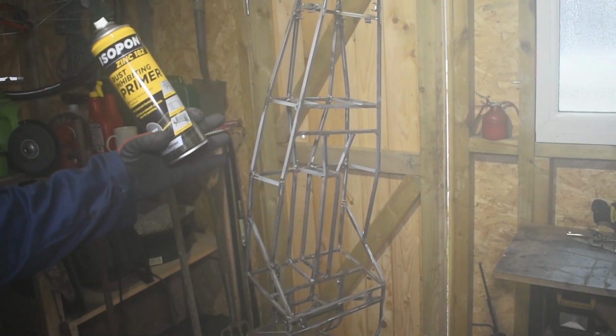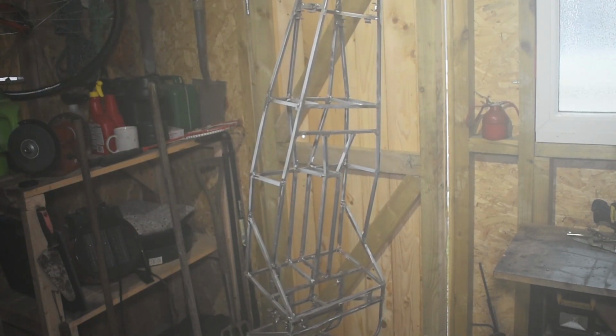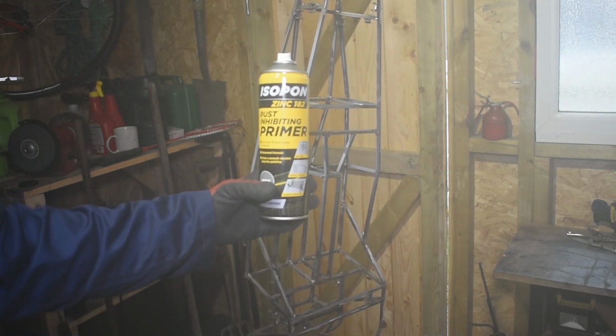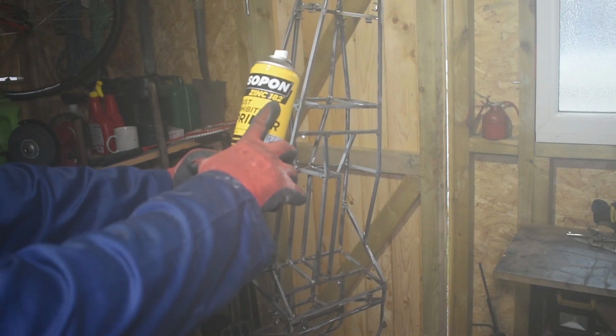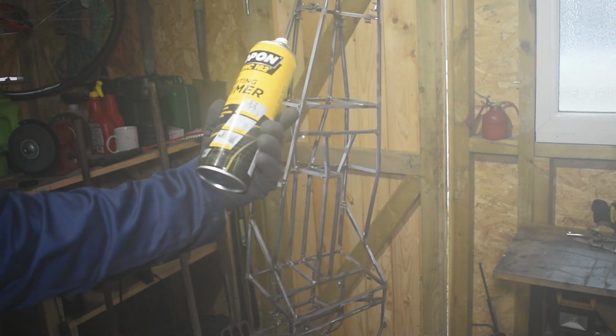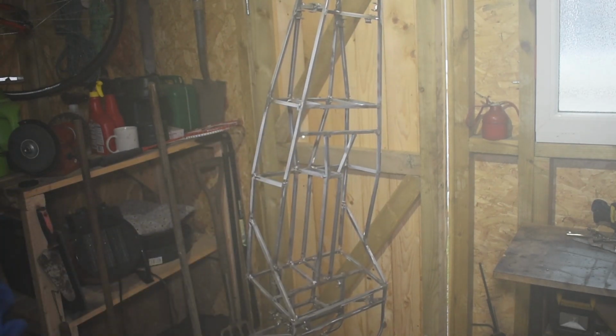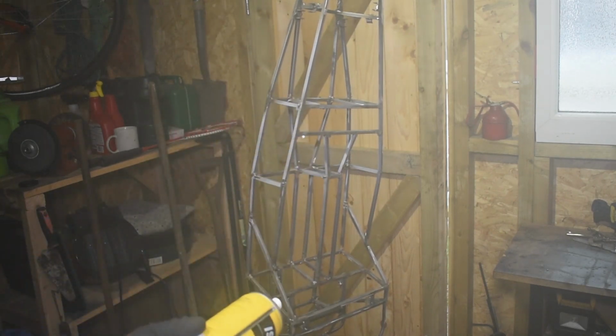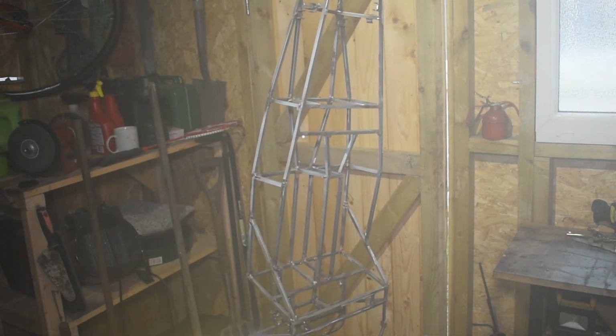So I've got the chassis finished now. All I'm going to do now is spray paint the chassis just to prevent any rust. I'm going to use this zinc 182 primer. I use this for everything. It's a zinc based primer, and I'll stick a link in the description to where you can get hold of this. So we'll get it sprayed up.